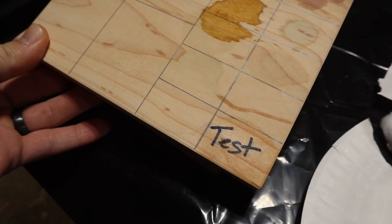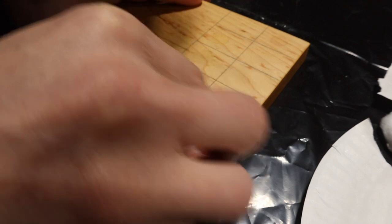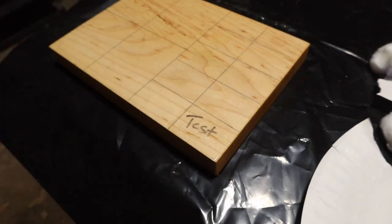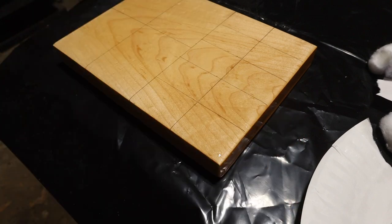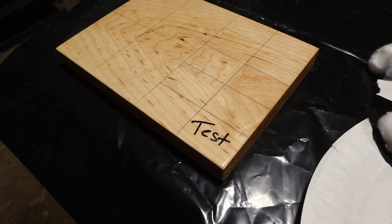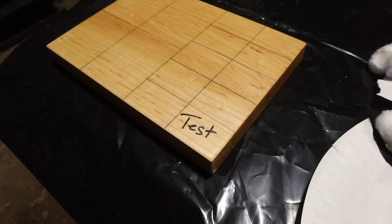Alrighty, not much happened on that control. Let's go ahead and try with the Rubio Monocoat. Not bad, it's certainly a little bit lighter, but it's not quite gone and you can still easily see it. Alrighty, next up is epoxy. And the epoxy, without even going the full 30 seconds, was entirely removed. That's exciting. Let's see how lacquer holds up. And after 30 seconds, it's a little bit faded like the Rubio Monocoat, still there quite a bit though. Last but not least, we have polyurethane.